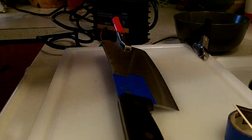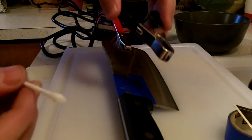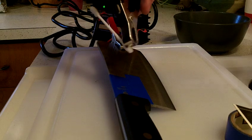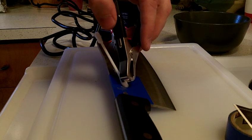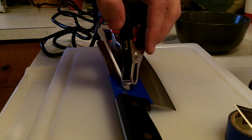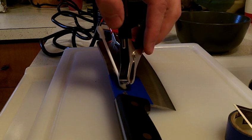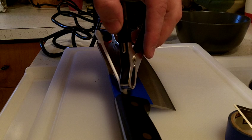You want to keep it pretty local. So what you'll do is plug the charger in and then clip the negative side of the charger to the wet side of the Q-tip itself. Then just go nice and evenly over the area you want etched. You'll hear it start to sizzle and it'll steam a little bit — that's a good thing, it'll let you know it's working. The longer you do it, the deeper your etch will be. You're basically burning away material.